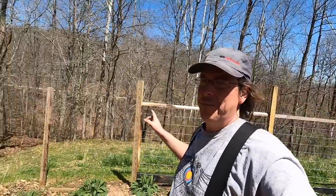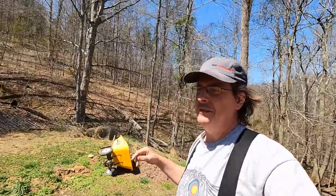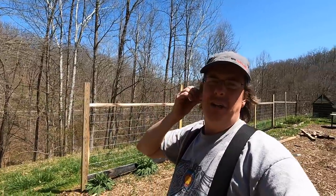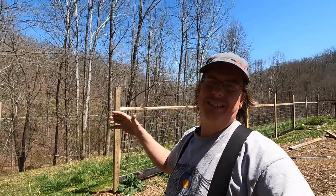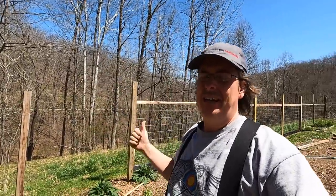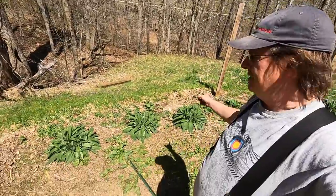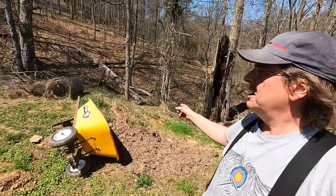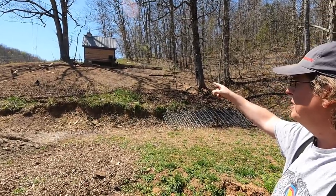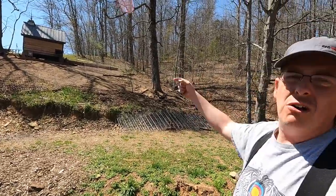But as we come around here, around the back where our tree line is, and then going up to the chicken church, because we want to tie all this together, we're going to switch from the timber and cattle panels, not only because it's going to be cheaper and less time to set all that up, but we're also going to have to start dealing with a lot of curves and a lot of undulation in terrain, and that style of fence just isn't going to work cleanly. So starting right here, this post, we're going to come around this curve. You can kind of see my comfrey is the edge of the border there, and we're going to come around and go right up this tree line, and then up there where you see the little retaining wall that some of the hens are in front of, taking advantage of that shade, we're going to turn and go toward the chicken church.